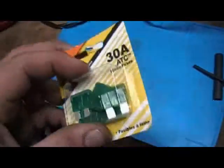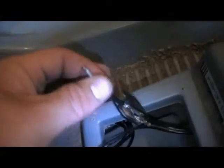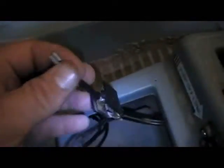Okay, I went up to Walmart real quick and I got a fuse block to put in the 6x6 wiring harness. I noticed that online there is a factory recall because these things were bursting into flames. And while looking at the original wiring, this goes into the joystick to bring power, and then from there it transmits power to either motor.